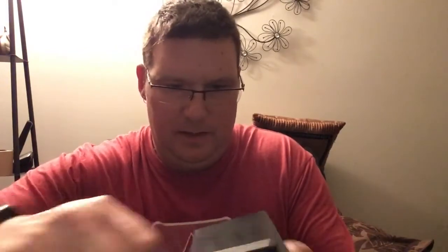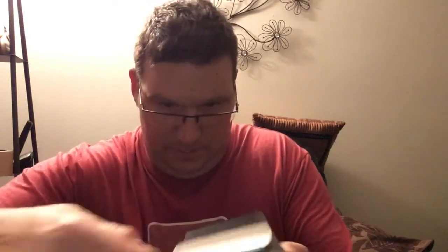So we're going to go for 25 laps on one side and then 25 on the other. So let's see if I can angle this. This is kind of awkward, but this is how I do it, okay? Now I'm not using any pressure here. Just letting the weight of the blade go up the strop. And I'm kind of pulling off a bit there. So I'll do a couple extra, just till I get the sound of that blade that I want to hear on the strop.